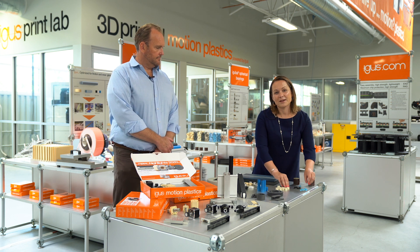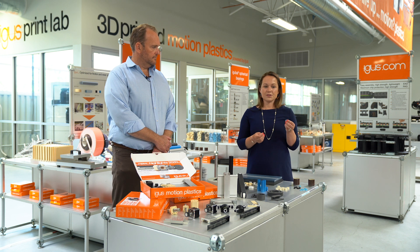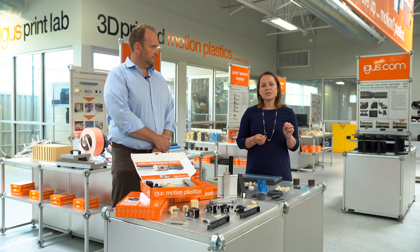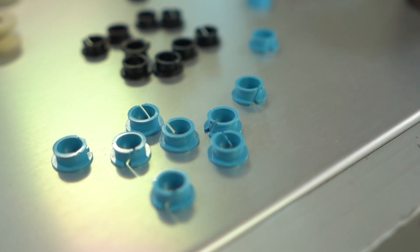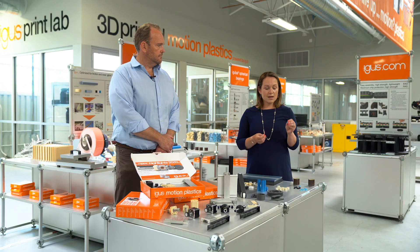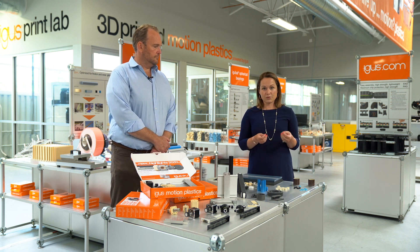From our clip bearings — we have always had clip bearings, but we've extended the offering by including different materials. We now have our A230 material, which is ideal for food contact applications. It meets both FDA and EU requirements, and the color makes it optically noticeable, so if it were to get into any food you'd be able to see it. In addition, we have our K250 clip bearing, which meets the needs of customers looking for an e-coating process — very common in automotive applications, and the K250 can withstand the e-coating process.